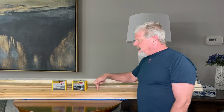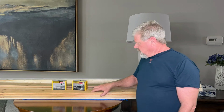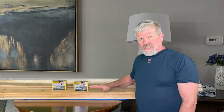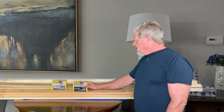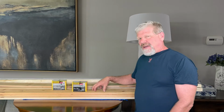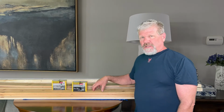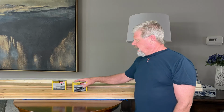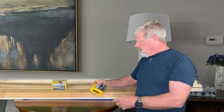Then you're going to need 9 6-foot cedar fence pickets. I'm using cedar because it's naturally bug resistant and weather resistant as well, and you won't have to worry about chemicals. I'm putting vegetables in this box, and I don't want to deal with the chemicals in it. I have in the past. I'm not going to do it anymore.